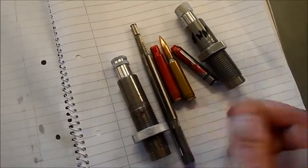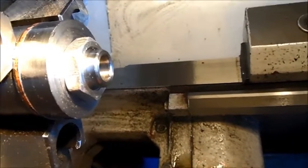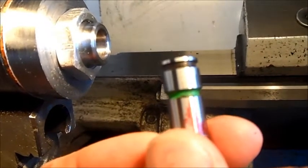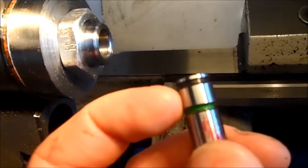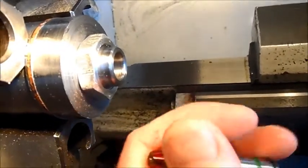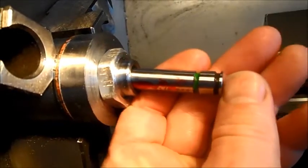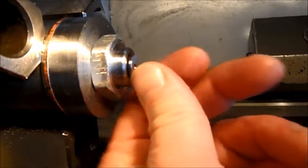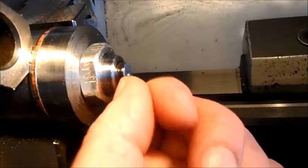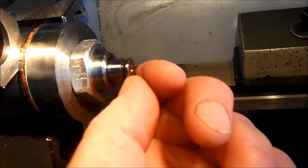So if we measured it with a clock or depth gauge it will read 1.8mm. That's because the die will hit the shell holder and we are dead sure there's play up to the neck, so you can't run it up to the neck. This is a seater die for 8x61 Norwegian S. The parent case is 9.3x62. If you have new cases there is no problem - they are smaller in outer dimension. But this one has been shot in a 9.3x62 chamber, so it's a used case picked up from the range.